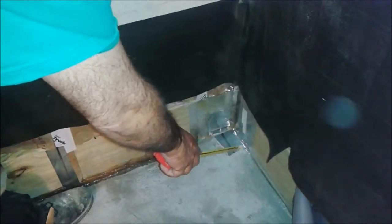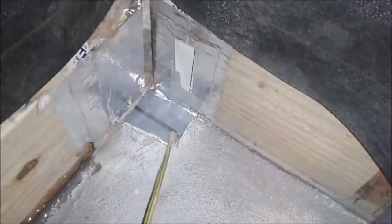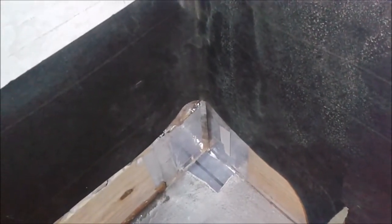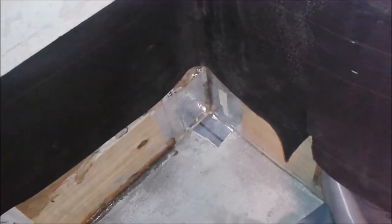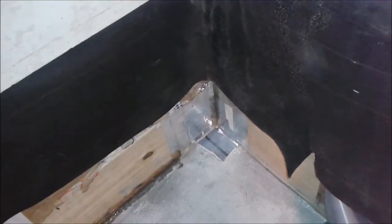Now here, if you can see, I actually cut and put a piece of this liner, the PVC. The reason is because this place was a little bit rough. So I cut a piece of PVC and I just glued it here. So now it's not rough anymore. I was afraid that the roughness here on the quick slope would hurt or scratch the liner with friction. It was very easy to do, and it's very nice now. If I touch it, it's perfectly done.